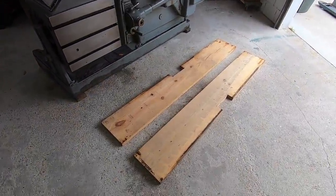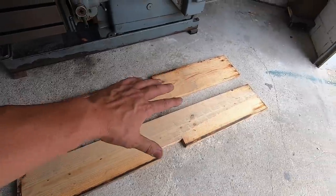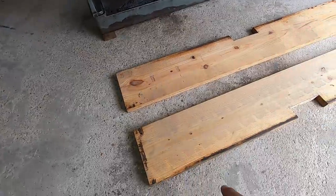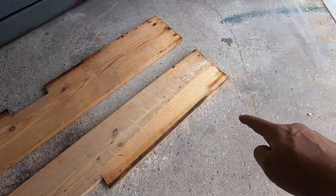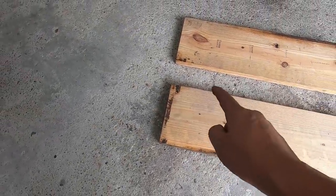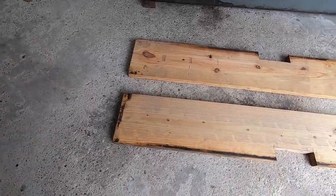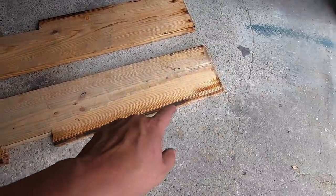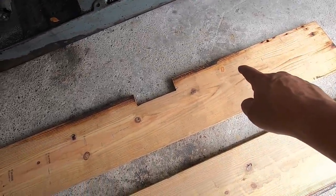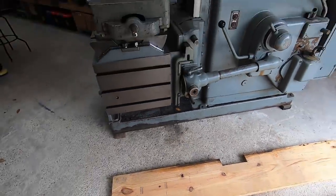The weighted machine is on all four of the wooden wedges now. Let's go take a look at our footprint on the 2x10s. So here's the telltale signs that my theory of the rocking machine I believe to be correct. I got them laid there just like they were underneath the machine. You can see where the edge of the base was lined up there down the side of the board, but it's only in the center - on the ends it's not touching there. Sitting really heavy in the middle, really not any touching in the back right there at all. So I believe we had a rocking machine.